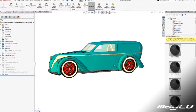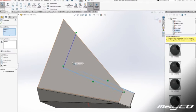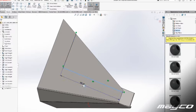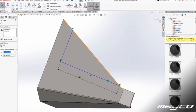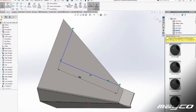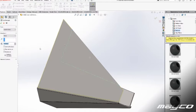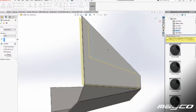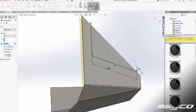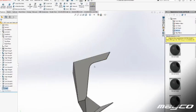In the tight space that I have, I want to have effectively 10 kilowatt-hours at least, with 80% DOD, maybe 90% DOD. DOD is depth of discharge. You cannot use a battery 100%. You always have to leave something in there, generally speaking. On the older batteries you could use 70%, so 30% had to be left in the battery. These days, they're going to 80%, 90%, to ensure that the battery doesn't die because you discharge it too far.